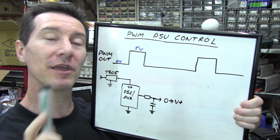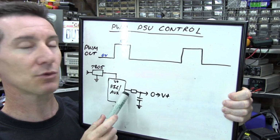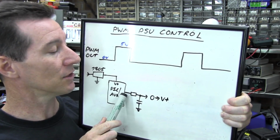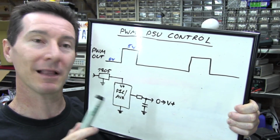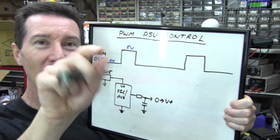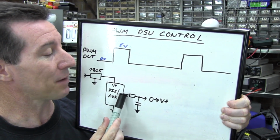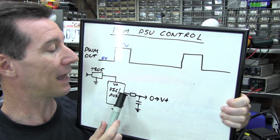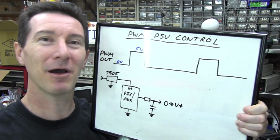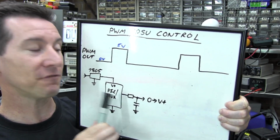microcontroller here, because the good thing about modern microcontrollers is that they're all CMOS. They're CMOS output, so they use FET switching on the output. So that means that they can get incredibly close, ridiculously close, to their input voltage rail up here on their output switching. So if you're powering your PIC from precisely 5 volts, 5.00000 volts, then you can pretty much expect close to that absolute accuracy on the output of your PWM here. There might be a millivolt drop or something like that, but it's going to be very, very close, okay, with these FET outputs.